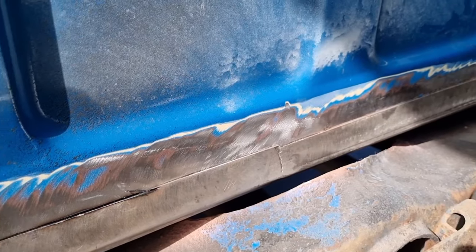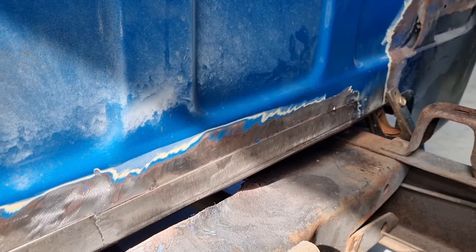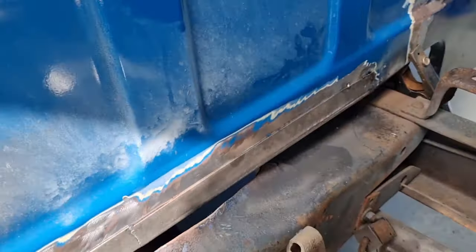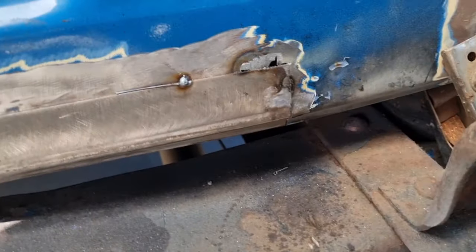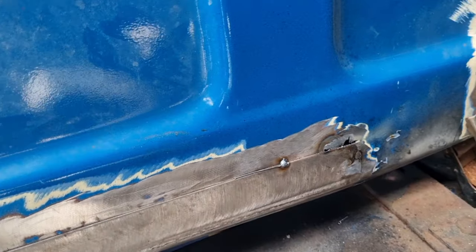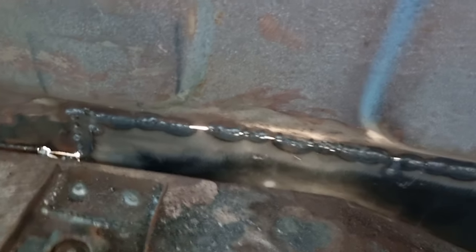So what I'm doing is starting from one end, working my way across, so that if the metal moves, if it grows a bit now, then it's all growing in the one direction and I can trim that end up at the end. There's a little bit of roughness in the remaining metal there, which I have no doubt I'm going to be blowing holes when I try and weld that, but it is what it is. In hindsight, probably could have gone another 3 inches and it would have been okay, but we're getting there. So we'll continue along with that and we'll get it all buzzed up. So those areas that are missed weld there, a bit more obvious when there's daylight outside, so we'll fix those up as well. Coming up okay.